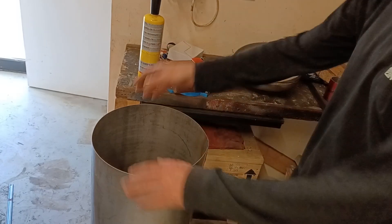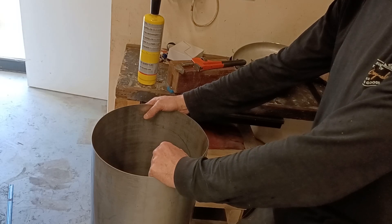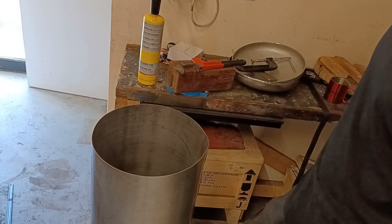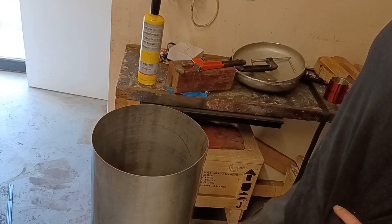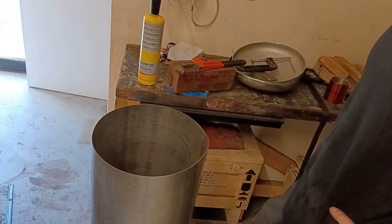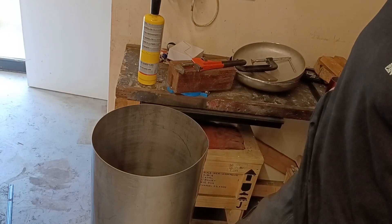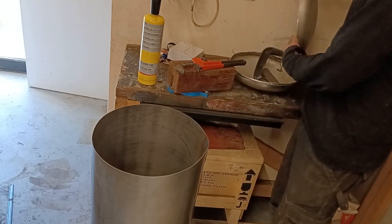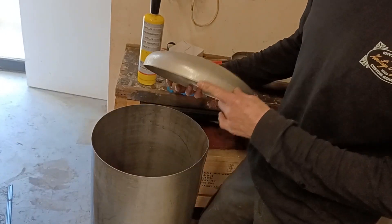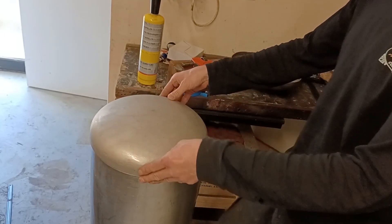The reason I went for the rolled tube method is because these were cheaper, but I should have got the tube in the first place. The problem is I have to get six metres of it - that's the minimum I can get. I've hunted everywhere: chimney flues, wheelie bins, ducting, air flues, all sorts of stuff on the internet. To get one that's 300mm at 1.5mm thick is really awkward. I've only found one place that does it, and that's the place I got the end caps from. So I'm just going to have to suck it up a bit.